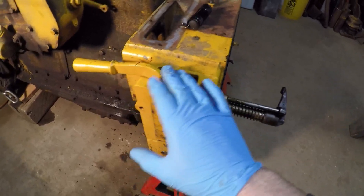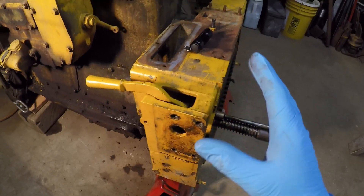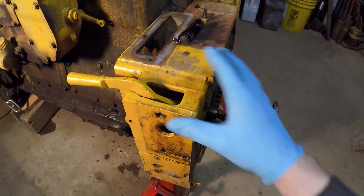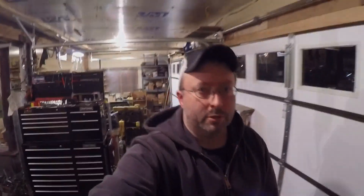So that's why you really don't want to take one of these mechanisms apart or loosen it out here if you don't have the tractor in an already disassembled enough state to really access all these components. You can make them all spring apart, but until you have everything fully disassembled, you can't take any one of these completely out. So that's pretty much all there is to know about that sliding engagement mechanism. It's a really simple setup, but if you don't take it apart at the right time, it can really get you in trouble. Thanks everybody for asking the question and requesting the video — I finally had the engine out where everything was in a fully visible state and had a good opportunity to do the video. As always, like, subscribe, comment below, and I hope to see you back again.